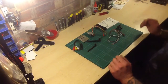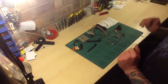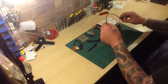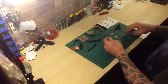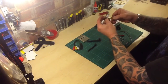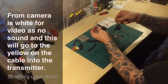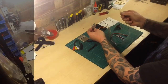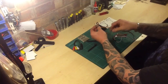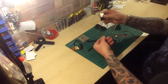This is the Hobby King 5.8 RC305 FPV system. It comes with a little Sony camera at 520 TV lines. The cable connector isn't correct for the transmitter, so I'll need to separate the wires — black, red, and yellow going into the camera. The yellow is going to go to the white, then the red and black into the camera. I'll cut this off, solder the wires on, and blank off the two sound wires since there's no sound on this camera. The power lead will go to the battery.